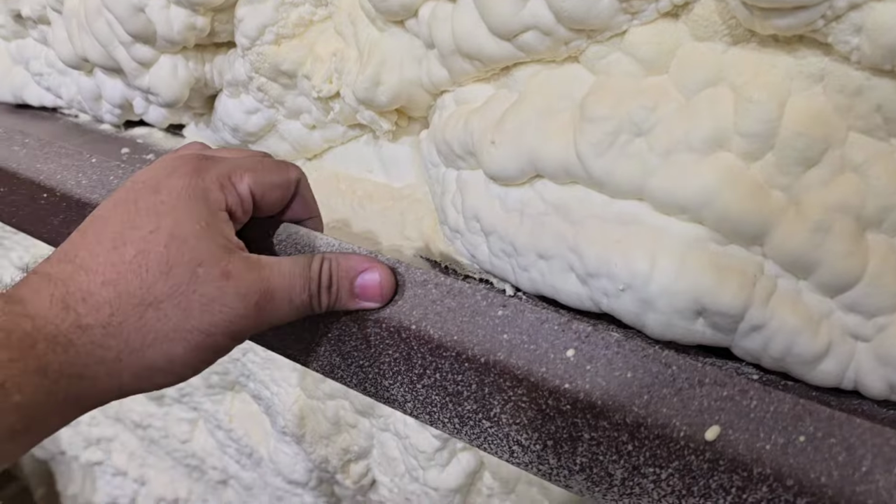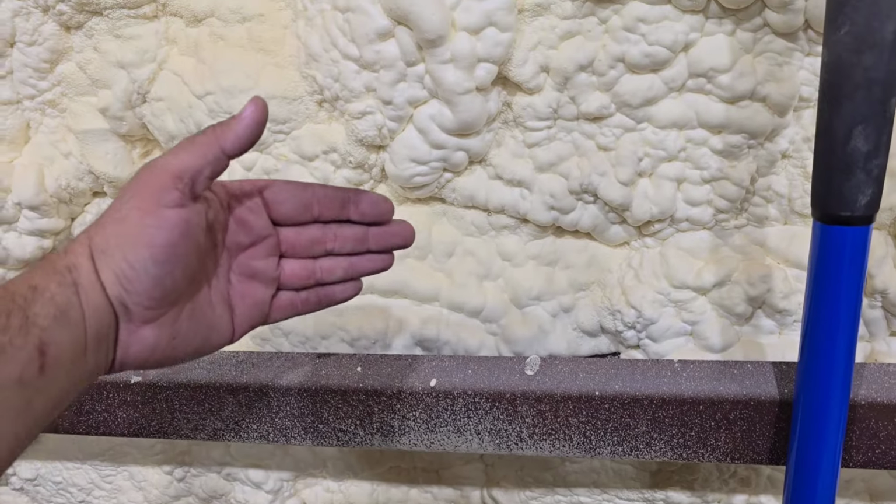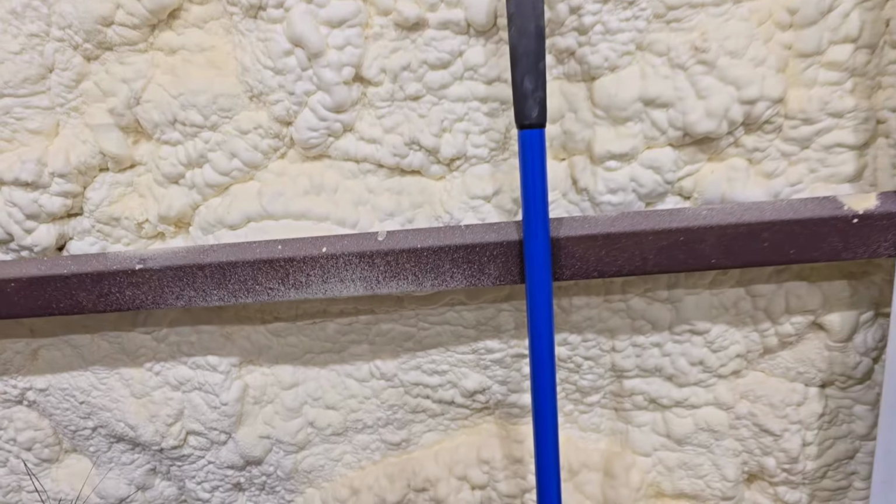But we didn't think, really, until after it got installed, that the problem is these beams are not very thick. They're honestly relatively thin, but it's the shape that gives them strength. But the problem is these things are meant for this way strength, not this way strength. They're pretty thin here. I know they're a Z-channel, but they don't have a lot of strength. So for that to happen, we needed to support the porch on the backside. And so that's why we ended up doing the pieces like we did out here, where we have the LVLs and the back post, to give the porch the weight. It could bear the weight on those posts and not on the actual metal itself.